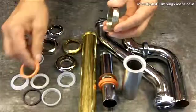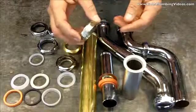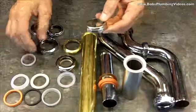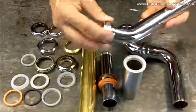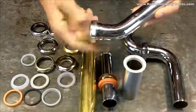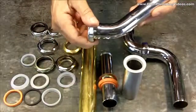That's why it's red. And these nuts, they do the trick, but what happens over time, these are die-cast zinc nuts, which is a pretty cheesy material. And what happens over time is they'll get fused on here. You won't be able to, after you tighten them, come back 6 months later to try to take them off. They just get fused on there.